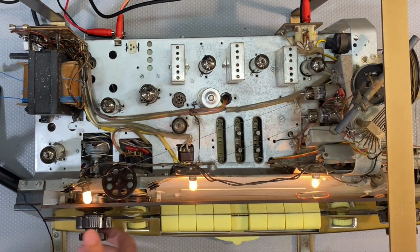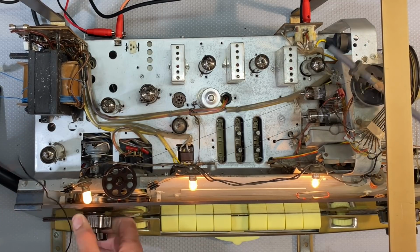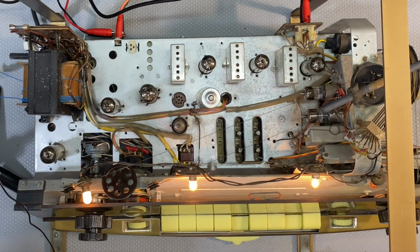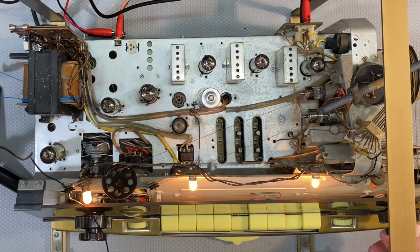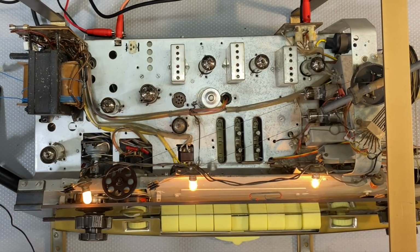Now they tell us to switch on the ferrite antenna, and to do that I've got to do this. In other words, I've got to deactivate the stop at the end. It's actually tuned into something. Put off automatic, put it in a place where I'm not receiving anything. Okay. Switch on the ferrite antenna, couple signal generator loosely to ferrite antenna by means of a ferrite rod or a coil. Press M at 570, so we're going to put this to 570 kilohertz. Adjust L13 and L4.